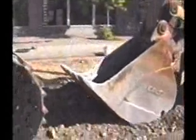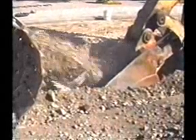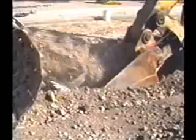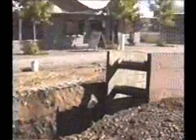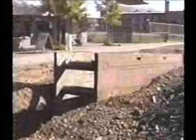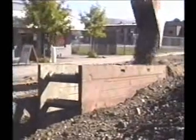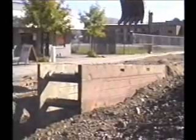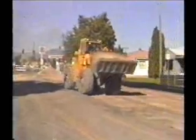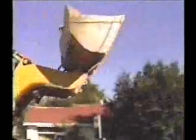Another benefit of the bedding conveyor is when a partial bucketful is required, there is no waiting for a loader or for the excavator to cycle out to a bedding box. The hopper is easily charged without interfering with the digging or pipe-laying functions of the excavator.